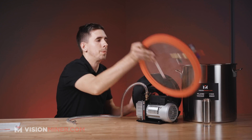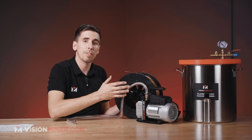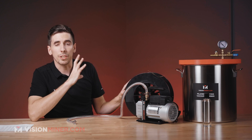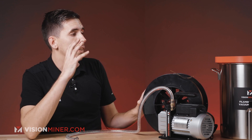The way this really works is we bake our filament — put it in the oven at the appropriate drying temperature for the polymer, since all polymers are a little bit different, for however many hours. Then when it's still hot, we take it out, put it in the vacuum chamber, pull the pressure, shake it around a little bit, leave it for 30 seconds to a minute, then release it and it's ready to go. You can optionally do that a couple times. This is really good for getting all that excess moisture out of nylon and low-temperature filaments, and it's a necessary component for PEEK, Ultem, PPSU, PSU, and all the other high-temp filaments we specialize in. It's one of the best ways to dry filament bone dry, which is critical to get the full mechanical properties out of the polymers you're printing with.